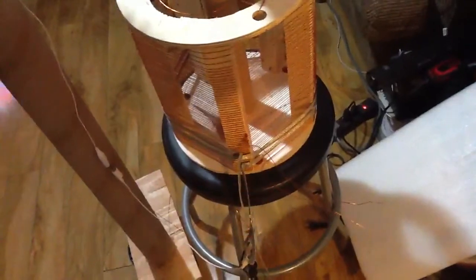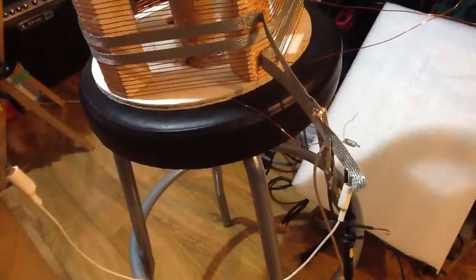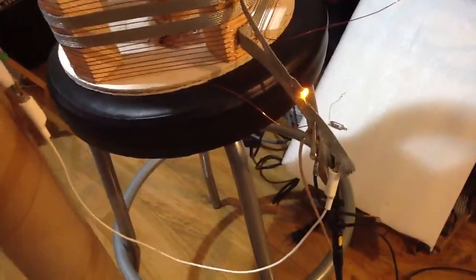We've got the base of the secondary here running up to this plate of metal, and that is positioned just a certain distance away from the top load here. You can see if I put my hand close, it kills it — brings the impedance up too high. So now we'll position this capacitive plate tower, pull it away, bring it back. Too close. Pull it away. There we go. Just from bringing this plate up to the top load, we can tune this thing.